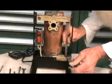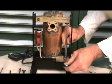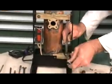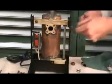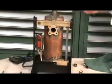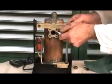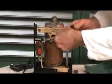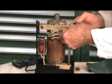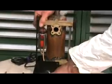I'd have to hold that still, but there it goes tight, and you can feel this as it goes a little snugger and a little snugger, but it won't leak even if you have it not near tight. You still have a very nice seal with those nice soft, and it's a funny thing because they're not exactly soft, these silicone seals. They have a hardness rating of the same as the rubber seals. 70 Duro, I believe, isn't it? That's correct. But that's hardness. It's not compressibility.